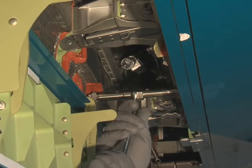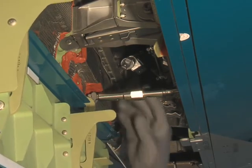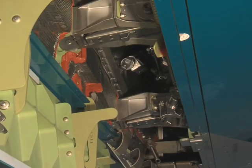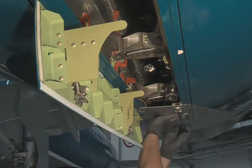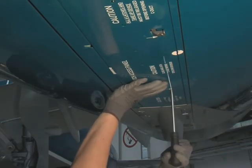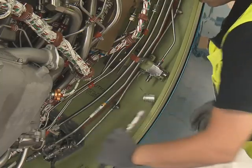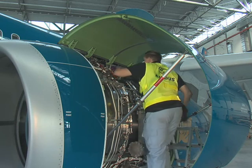Turn the auxiliary latch assembly to make it longer and disengage it from the hook on the right-hand thrust reverser half. Then, stow the auxiliary latch assembly into the retention clip. Close the thrust reverser pressure relief doors. Disconnect the flexible hose of the hydraulic hand pump from the actuator manifold connector of the thrust reverser half and activate the thrust reverser hydraulic control unit.